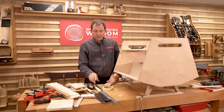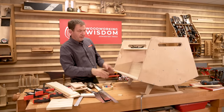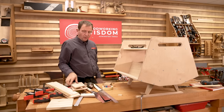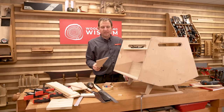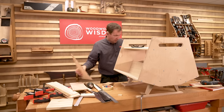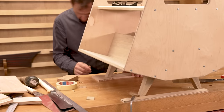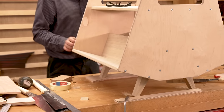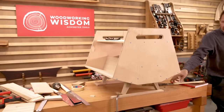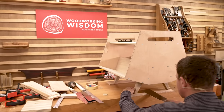So we cut the first two feet off, so we clamp them, we've got that piece of ply. Now having done two and you swing it around, the whole unit will drop. So I need to prop them up, so I need the same thickness of the plywood. So these are the offcuts we had. I'm going to just put those under those two feet we've cut. That sits it all square again. Now I can come back round and we can do the other two here.